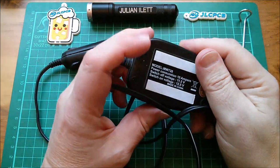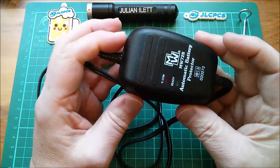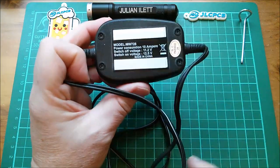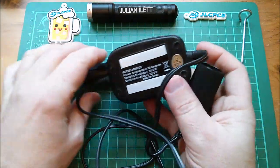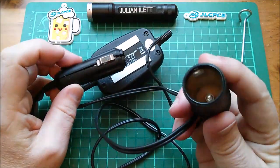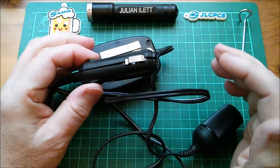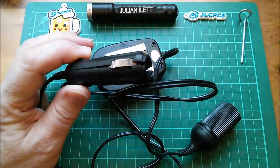Look what it says on the back: it says power consumption 10 amperes. Well, this box doesn't consume 10 amperes — it's just got a relay in it — but that to me means you can put 10 amperes through this thing, through all parts of it. The cable gets a bit warm at 10 amperes, the socket seemed to survive, but the plug, because I put 10 amperes through it for about half an hour, completely melts.